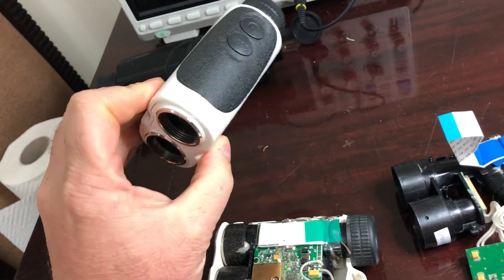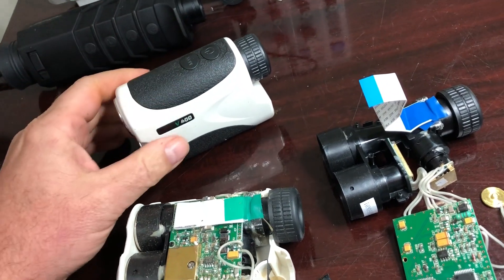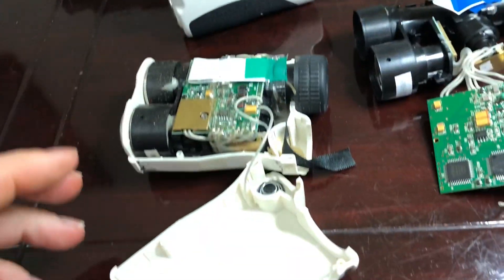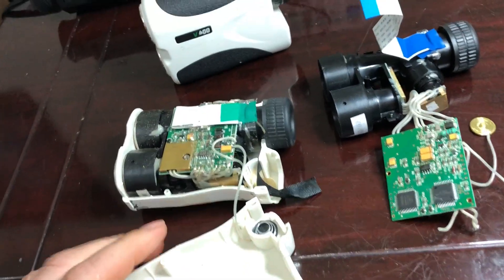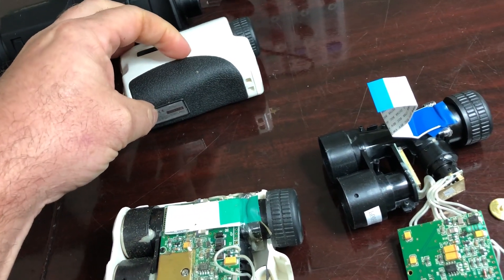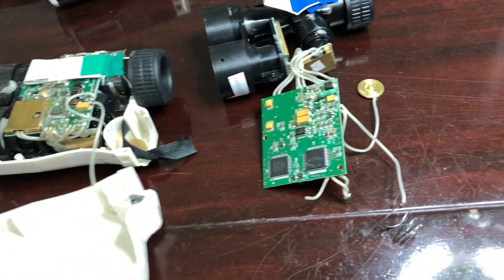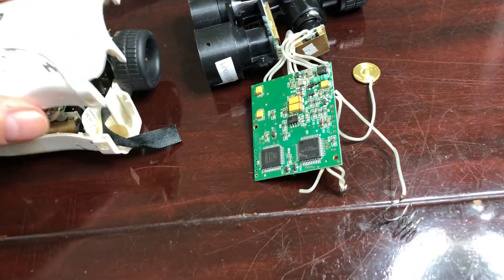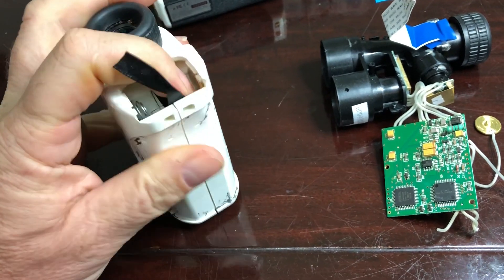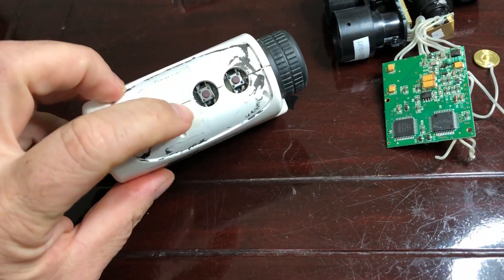Here's the unit about being torn apart. If you do get one of these, there are four screws. Two are under here — you've got to get a flat-edge screwdriver under that rubber to rip it up a little, then pull it off. Same thing on the bottom: get a screwdriver under that, get a little bit of it torn up, then pull it off and get to the other two screws. After that, you can crack it open with a wide wedge screwdriver jammed in here, but there's tape here that needs to be cut.